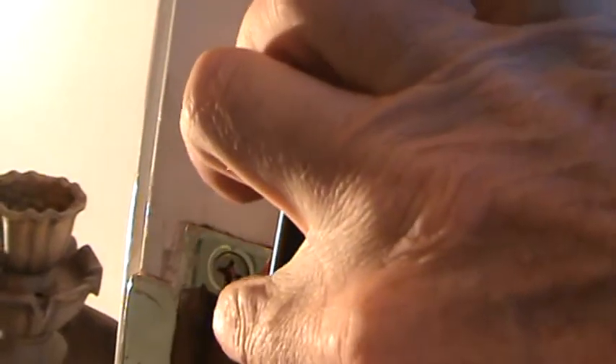You want to use a long enough screw so it goes right through this jamb, through the shimming gap, and into the two-by-four — that's your security. If you just have small screws there, somebody can break in really easily. All they have to do is push on the door and the jamb right here cracks and gives out. This screw goes all the way in now. There's also a different type of strike plate for a deadbolt that has a backing plate where you put two screws and two screws with finish screws on the outside — that gives you even more security.